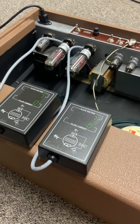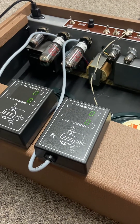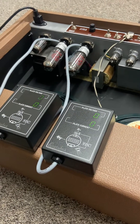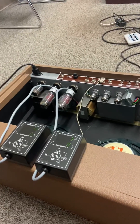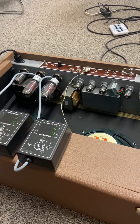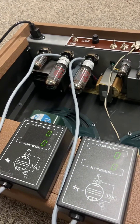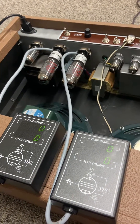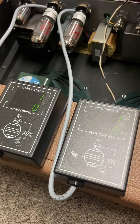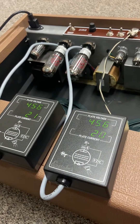I'm testing out the newest version of the Eurotube ET-Pro1 with wattage reading on this Fender VibroVerb clone that I just built — a Mojotone kit 6G16. I've installed a set of JJ6L6GC tubes, which you can see with the bias probes in series. The amp is warmed up, so let's flip on the standby and see what these new probes show us.